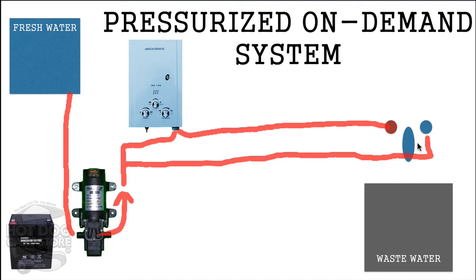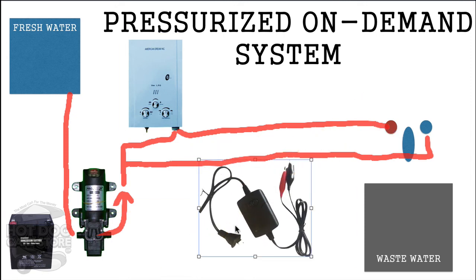It's really easy. You can get a trickle charger — about once a week you plug it in, it clips onto your battery and plugs into the wall to charge it up. Then you put the battery back on the cart and hook it to those wires. Now you have a pressurized water system. As soon as you turn on the faucet, it kicks on the pump and water flows. If you turn on the cold, it runs out cold. If you turn on hot, it comes into the heater, heats it up, and runs it back out to your hot side instantly. It won't run out unless your tank runs out. And it doesn't matter if the tank is up high anymore — it could be down low next to the wastewater tank, because the pump is going to pull it and run it to the heater or to the cold side.